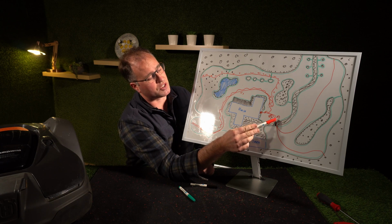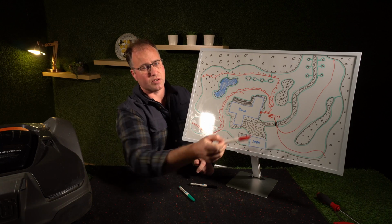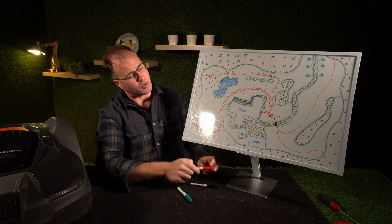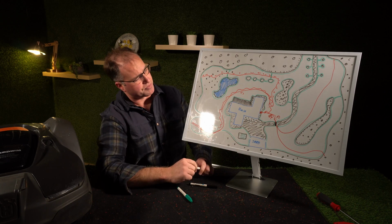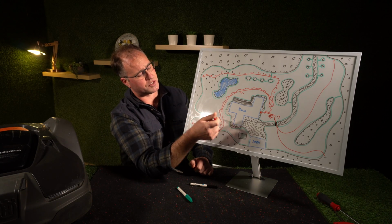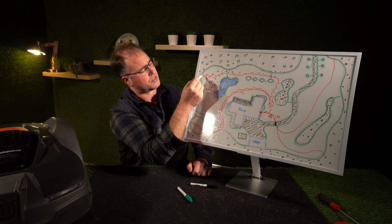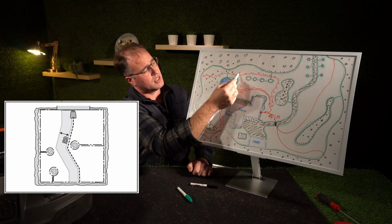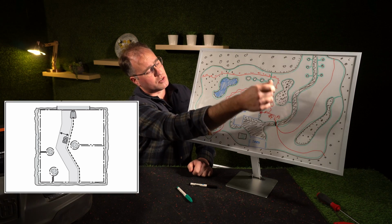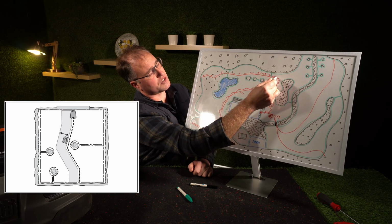But even so, you could still often have that at 9 and it'll automatically go into passage handling mode when it gets to a situation like that. But the key about that, the corridor width and how the mower follows the guide wire back, is it always follows on the left hand side. You'll see through here when it's travelling back, when it's looking at the charge station, it's always going to be on the left side of the wire.